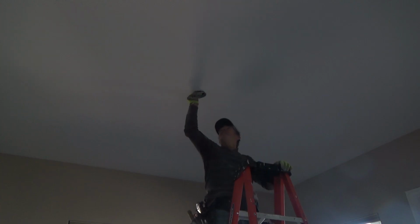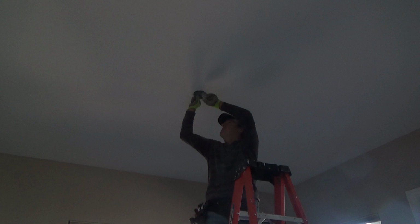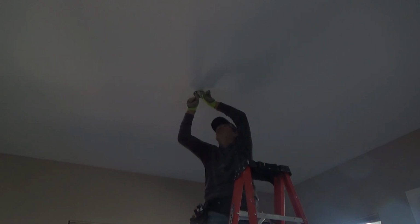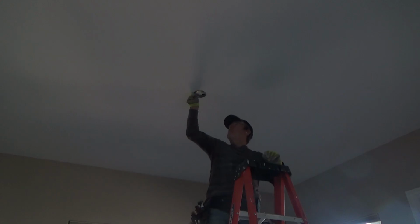But you know, I'm kind of anxious to see whether or not I can get that wire up through there. And so should we try to do that next? I mean, with this box, before I snap that piece in, I'm going to hold it up here, make a determination where my ground screw is. I'm glad on this one I got the ground screw up in this cavity, so I can put the ground screw on without drilling a hole. Had this been flipped around, the ground screw would have been right into the TJI. I would have had to drill a little hole to get the screw all the way up through there. And I wasn't paying attention last time I put the last box in.